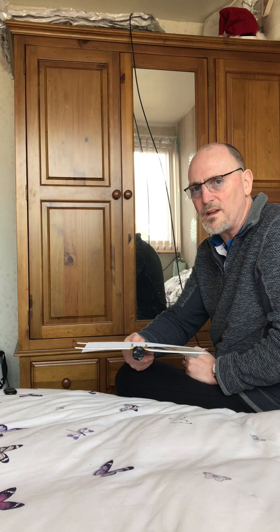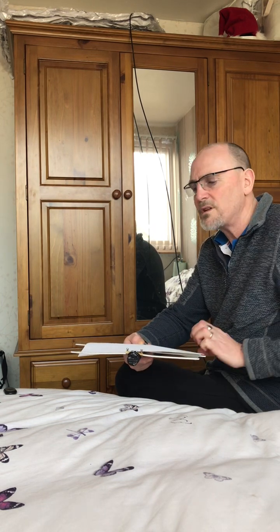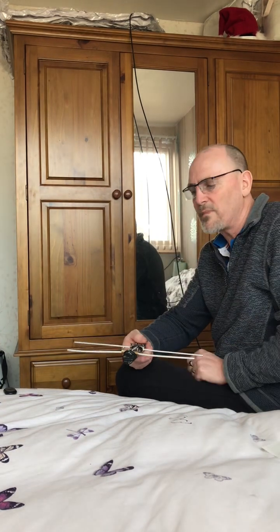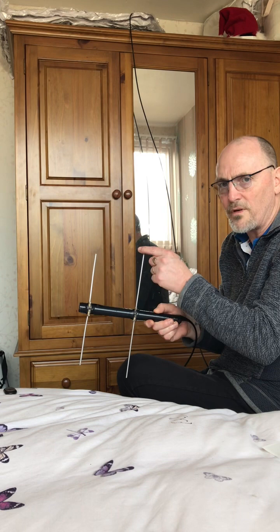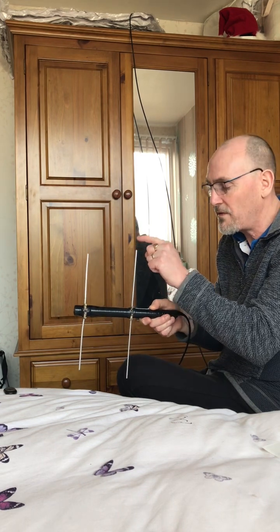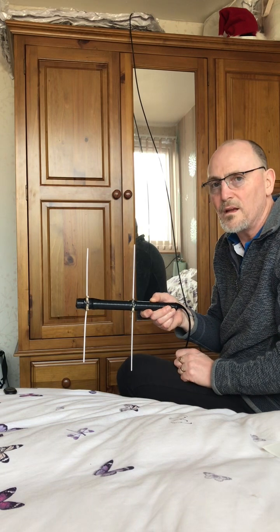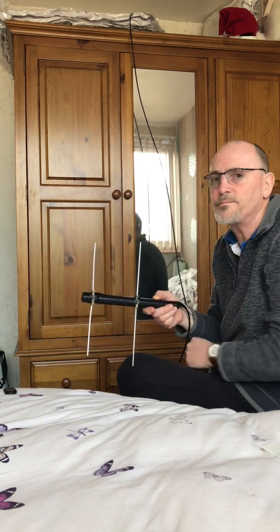Now, two gents in the 1960s called Mr. Uda and Mr. Yagi found out if you took the dipole and you added a second element called a reflector, which is just longer than a 1/2 wavelength from there to there, your energy, most of it, will be transferred forwards.